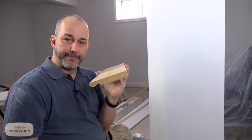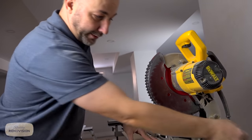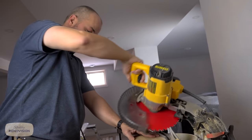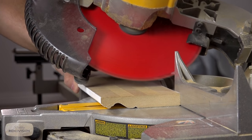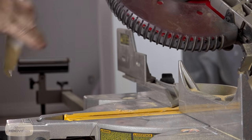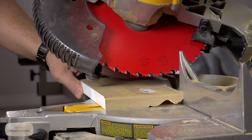first, I'm going to cut both my outside corners on my saw. I love my saw here, first of all, because if I keep the wheel in the back loose, whenever I want to make my outside corners, done. Right, all I do, come up to that pencil mark that we make on the wall, cut from the backside, and you've already automatically got your outside corner.